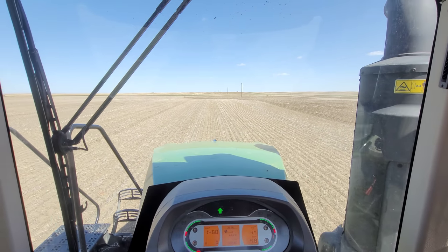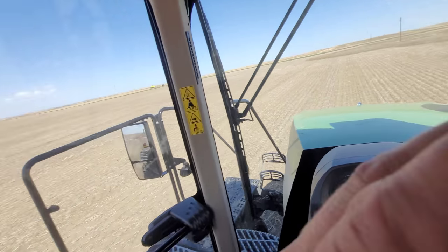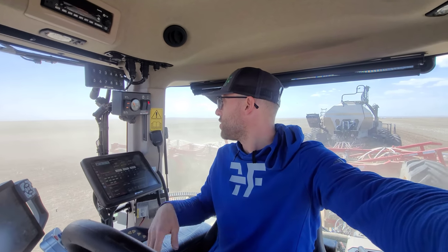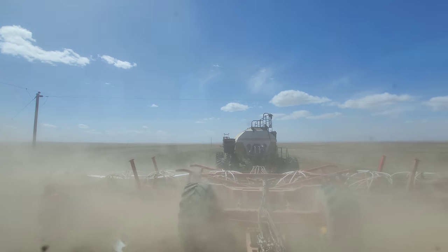Mike, what do you do if you do take down a power line and you have to make that terrible decision of what do you do now? Well, you wait in your tractor. You just wait. You get on your phone, you call SaskPower or your power company, call your family and friends, say hey this is the situation - this thing is parked on my drill or combine or sprayer. And you just wait until that power gets shut off. If you have no other choice, your cab is on fire, you are going to burn to death - well, I'm going to risk it. There's the one pole I went around that has the tie-down cable on it. You can't really tell that cable from here.